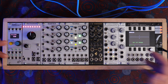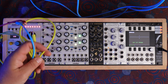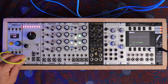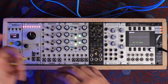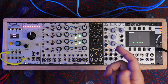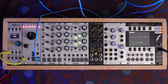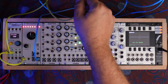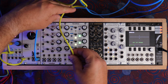I've got the Honey Eater right here and a handful of choice modules that I'm going to use to build a patch — I'll walk you through each step. I'm going to try and color code things so you can follow the signal paths. So let's start out from PAMS. I'm going to use that to set the clock and we'll go into the Turing Machine from Music Thing Modular, which is going to provide our random CV that we're going to use as a sequence. The Turing Machine sends out unquantized voltage, so we're going to want Ornament & Crime — which is off the screen — and we'll send the CV out of the Turing Machine into Ornament & Crime. I'll use another output from PAMS just as another trigger to trigger the quantizer, and it's also going to be multiplied to trigger our gates.